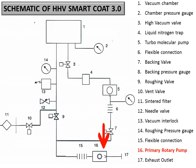and wait for 15 to 20 minutes for it to reach its maximum speed. Then again, we connect this rotary to the roughing to make the pressure in roughing less than 5e-2 millibar. Then again, connect to the backing line of the turbo. Then we open 3, means the gate valve or high vac valve. So now the turbo is pumping the chamber, and after 2 minutes we can turn on the Penning gauge to read the pressure, and after 10 minutes we note down the pressure to check the health of the pumping system or vacuum system.